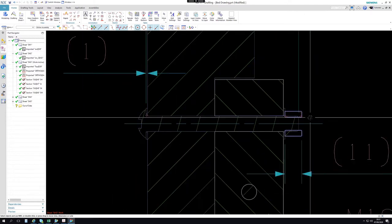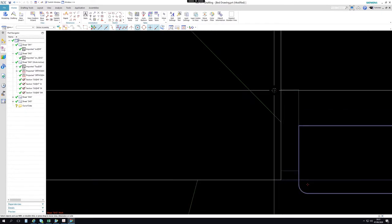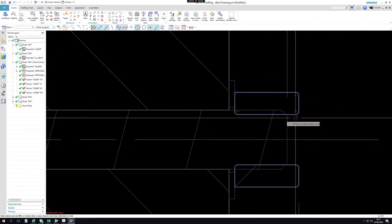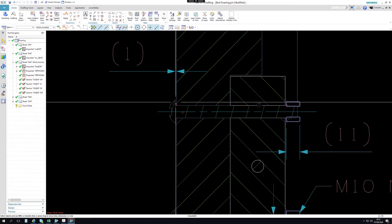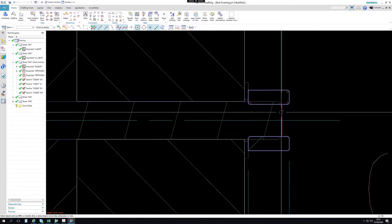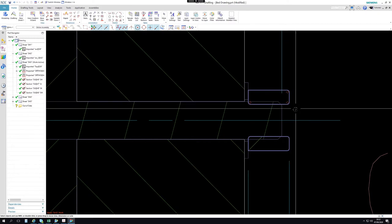And what tends to happen is, after you've built this, this washer will be sitting directly on this face, but over time the washer will get pulled into the face slightly. So basically what you want to allow for is a little bit of movement here for the end of the bolt to come through. And what happens is, when this gets pulled in a fraction, it gets pulled in a fraction either side after the first couple of weeks. Because after the first couple of weeks, you'll go around and tighten these up, and then they'll be solid and you won't need to touch them after that. What will happen is this will come slightly further in, and it's pretty much ideal. You don't want this really sticking outside of this nut because you'll have like sharp edges.